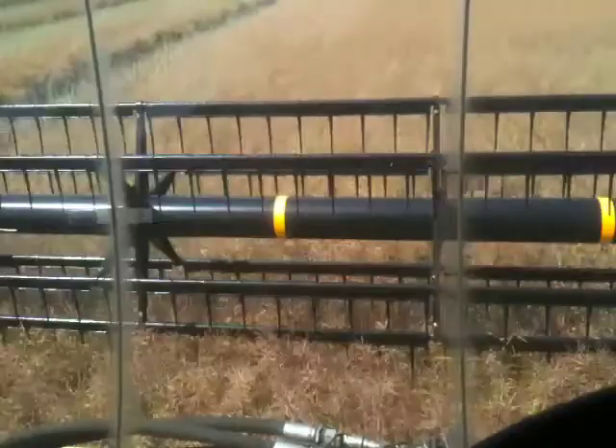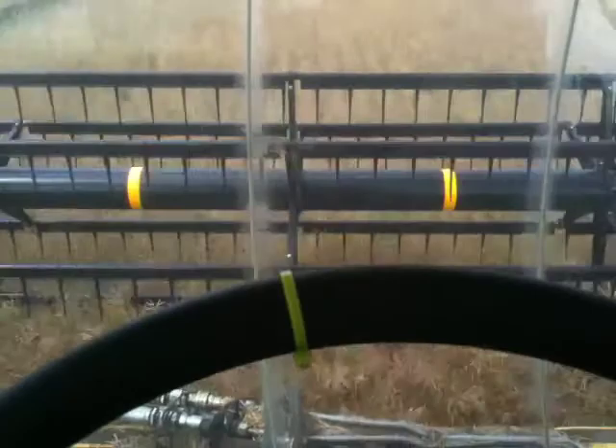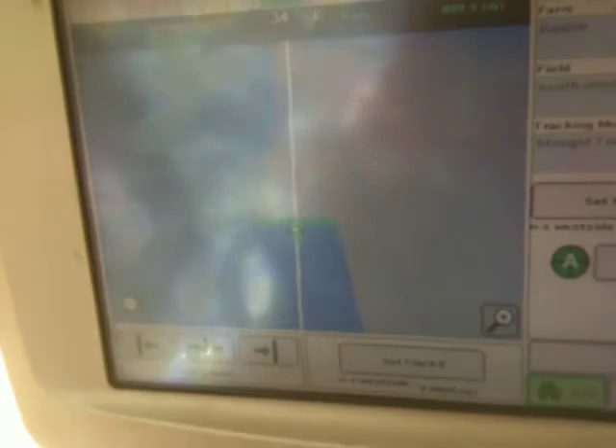The spray cart's not the only cool thing that I thought you might like to see. Most of our products — our tractors etc — now have auto steer in them, which means they are guided by GPS satellites. We've got our steering screen up here; it shows us how close we're tracking and how many centimetres we're off our line. We can also go in here and get some stats on how we're going — I've done nearly 25 hectares in this paddock, and the average productivity is 11 hectares an hour for this field, plus some fuel usage figures.